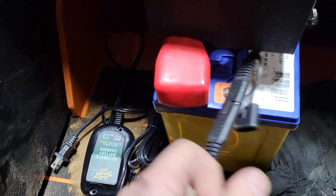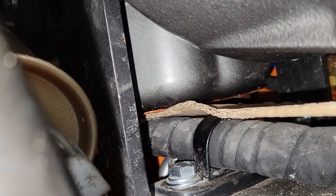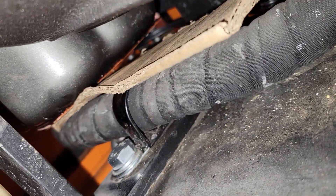To do that, you need a good battery. The other thing I'm going to do is down here at the oil pan — I found that's the best place to stick an engine block heater. It's going to be a little difficult to get my hands in here; it is tight-spaced when you're working with a machine that's literally about 40 inches wide with 27 horsepower. I'm going to use a little cardboard and wedge it up in there until the 3M sticky dries really nice and good, and then I should have a working block heater when I need it.